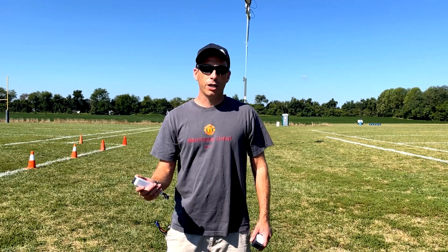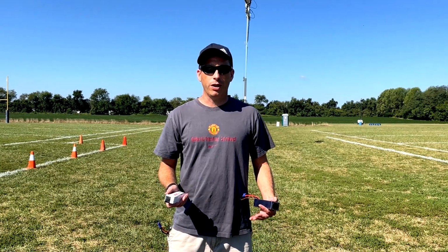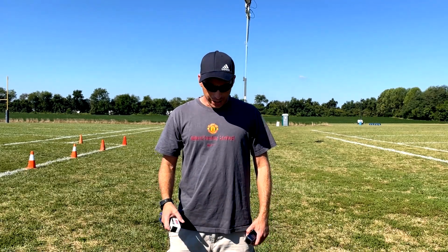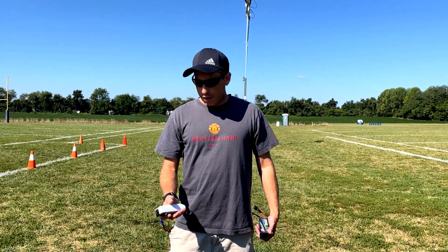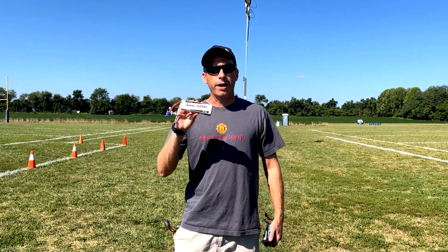So when I tested those four batteries from 3.7 volts per cell up to a full charge, they only held about 2,400 to 2,500 milliamp hours. So not a whole lot of their claimed 5,200 milliamp hour capacity is usable in a high demand situation. I thought that's just the way a lot of inexpensive LiPos were until I tested the Sypom battery.